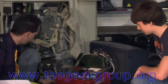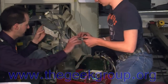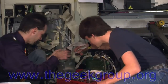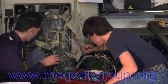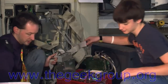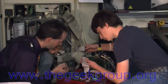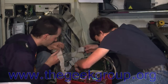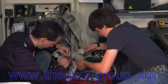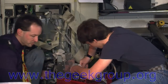there. Now we take our IDE. Here, you take that out. Right. That's IDE2. It'll be the CD-ROM drive. IDE cables in. It'd probably be easier to get IDE1 first then. Okay, well, here, IDE1. And here's the floppy. Okay, the floppy is in. And I'm gonna do power.